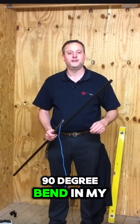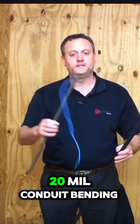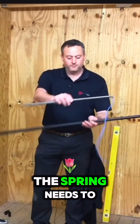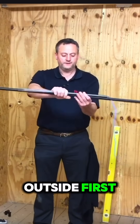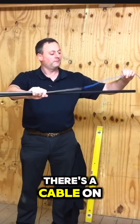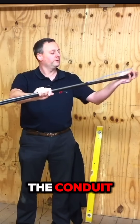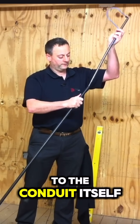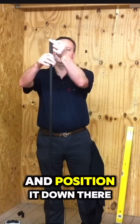I'm ready to try and put my 90 degree bend in my PVC conduit. We're going to use a 20 mil conduit bending spring to prevent the conduit from collapsing when we bend it. The spring needs to be offered up on the outside first in order to work out the position where you want to start the bend. There's a cable on the outside to prevent it getting trapped inside the conduit. Just fold it over in order that I can drop it into the conduit itself and position it down.